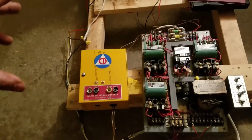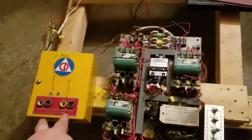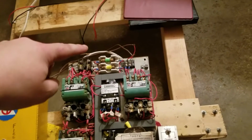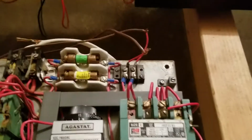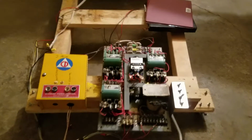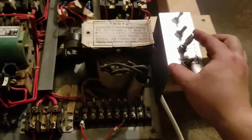All that basically does is create a fancy relay to activate the siren. Because if I press a button, the circuit between the screws in there closes, meaning the circuit up there at the control point on the RCM closes. And at that point, it activates the whole siren, whatever you do, whether you hit attack or alert. And you can also obviously control it individually.